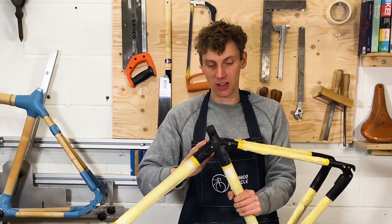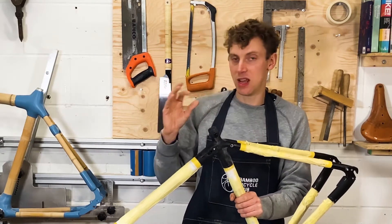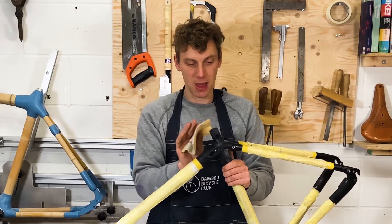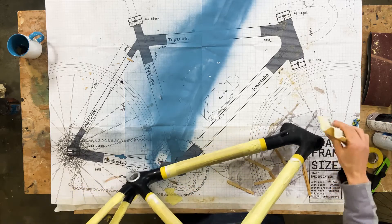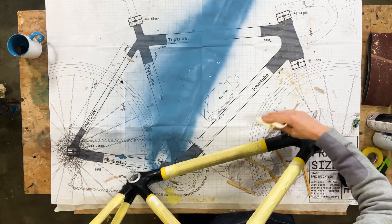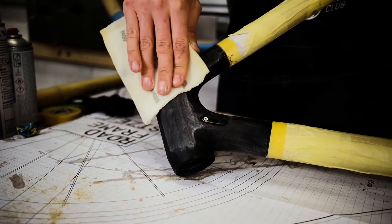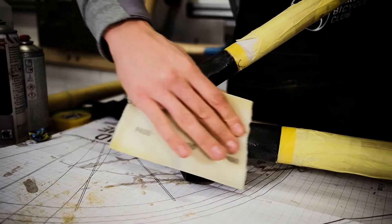What I would do is just take a very light sandpaper — 400 grit, you can get it at a DIY shop or anywhere like that — and just give everything a very gentle sand. That's going to lift off any dirt and add a slight key to the surface so the paint will bond a bit better.